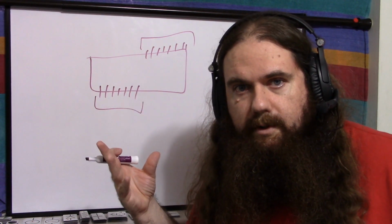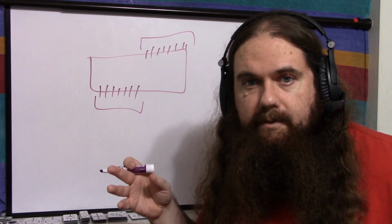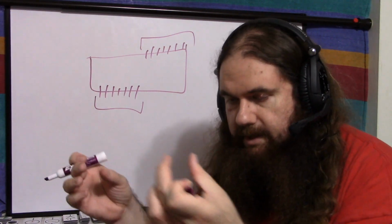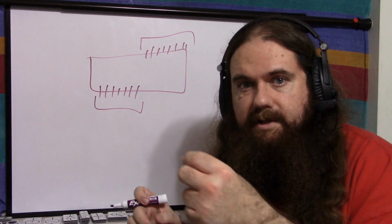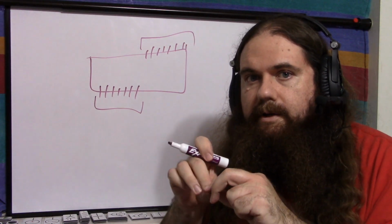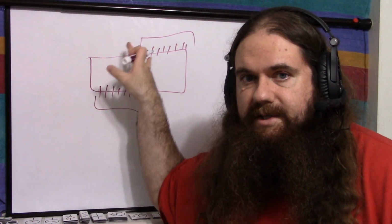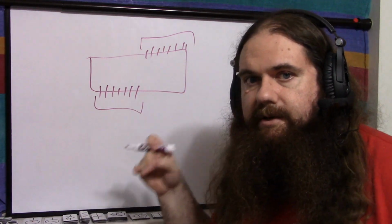The Arduino Uno, all the Arduinos, are kind of fancy breakout boards. A breakout board is where you've got a chip, but then it breaks it out and you've got the little headers you can put pins in, and it makes it easy to work with a chip that's otherwise just soldered. So that's kind of what an Arduino is. Instead of having this DIP or even surface mount chip that you have to deal with somehow, you've got the capacitors and resistors and LEDs and bootloaders and all, they're already on there, and you just plug it in.